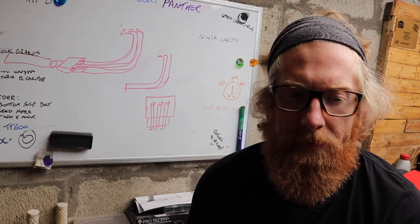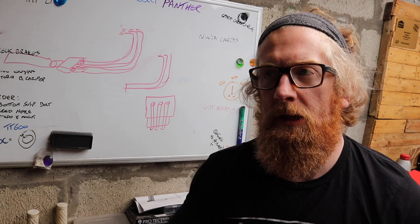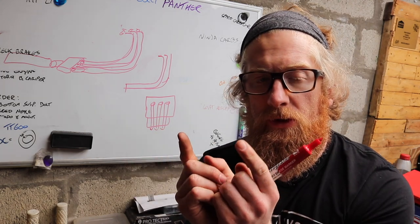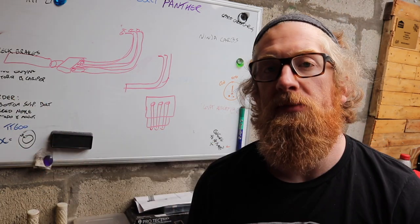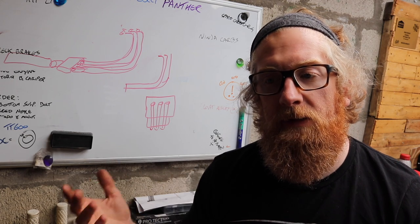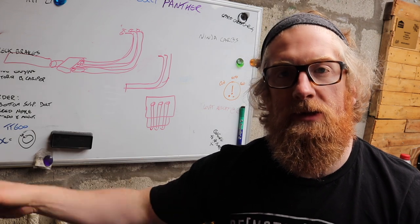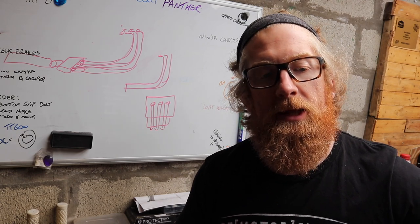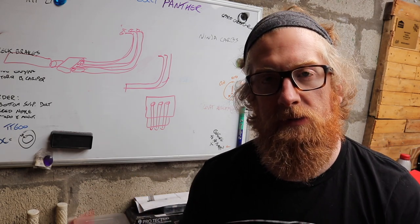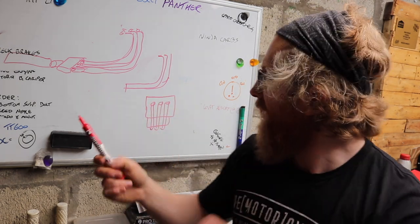But what I want to try and model is, if I've got a 3x3 system, can I stagger the lengths of those ever so slightly? Obviously if you make one exhaust really, really short, and one absolutely massive, you are going to see a difference in engine performance, especially with the length of time that gas is taking to exit. If the one with the really short exhaust takes no time at all, that may actually be beneficial. If the one takes much longer, then you may have an imbalance between your cylinders in terms of each individual cylinder's performance.